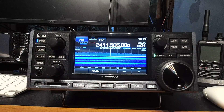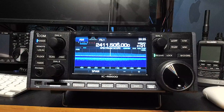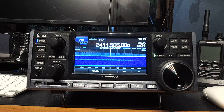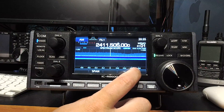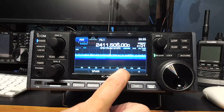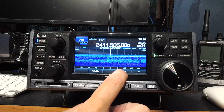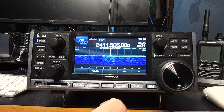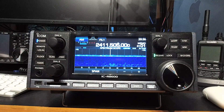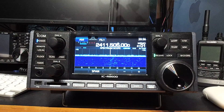In the end we went out to about a megahertz of bandwidth on the scope, which shows you the bursts of activity and the bunch of singular carriers, but the fact is there's just not enough resolution on the scope to display all the carriers. So I'll zoom back in to what looks to be the ideal level. Now we're looking at about 20 kilohertz worth of bandwidth, and it is quite obvious — the activity. You can see that it's sporadic, because as I said it's using Direct Sequence Spread Spectrum.